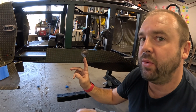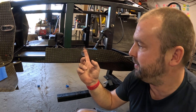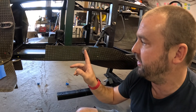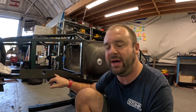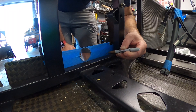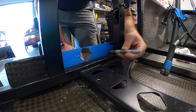We've got this inch-and-a-half hole right where we need it to be, but it left us with barely nothing on the top here. What we're going to end up doing is actually making this a channel rather than a hole, and that will get rid of the splintering possibility. Now we're going to locate the lower control arm bolt hole, but I'm not sure how to get that one done so we're going to figure it out as we go.